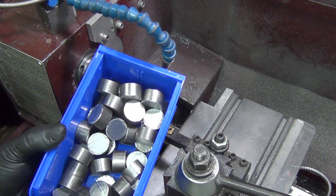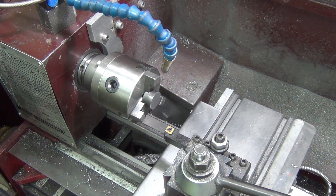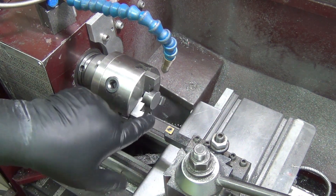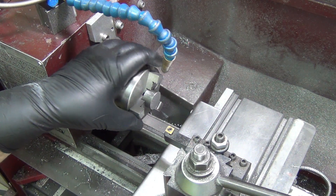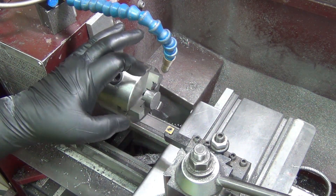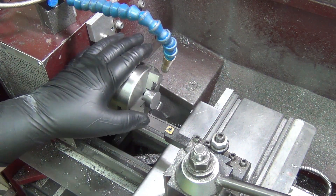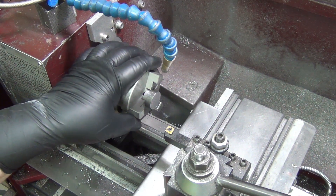I cut up this many — that's about a two-and-a-half foot bar with about a two-inch piece of leftover scrap. I got the first one in here and it's kind of close, but I do clear the jaws. This makes it a perfect way to hold it: the first pass doesn't have to be extremely accurate, but I cut it flat, then flip it over, push it in firm, and cut it — getting both sides really close to parallel.